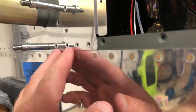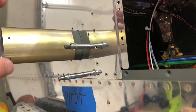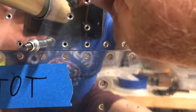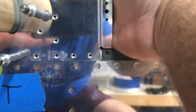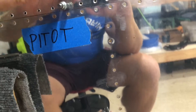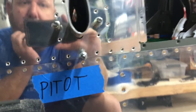To wrap up the pitot installation, I could not be happier with this. There's an L bracket on the other side of those rivets that's already been riveted in and then final drilled to share these three holes. So it's riveted to this rib right here and then drilled to match these three holes. The actual plate also shares the spar at the bottom. It's solid and I couldn't be happier with the job I did on this.